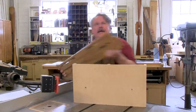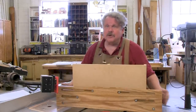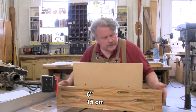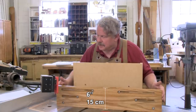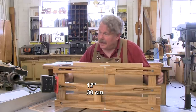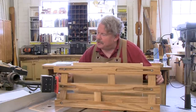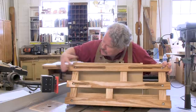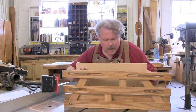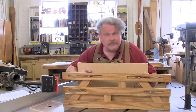This is also a tall fence. It starts out at six inches — that's about 15 centimeters — and goes on up to 12 inches, or 30 centimeters, and it can be adjusted anywhere in between. You see these machine bolts right here? You just loosen those, put it where you want it, tighten them down, and there you go.